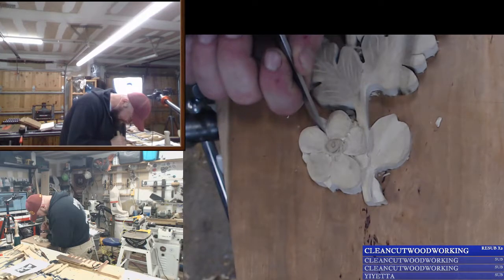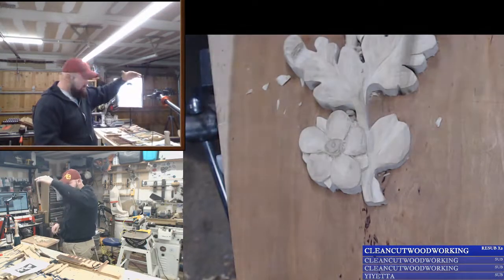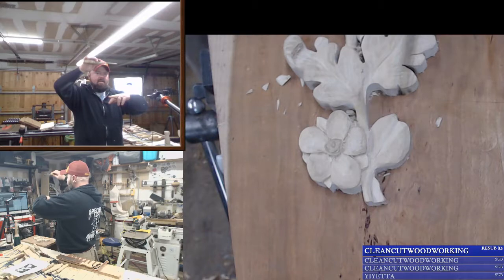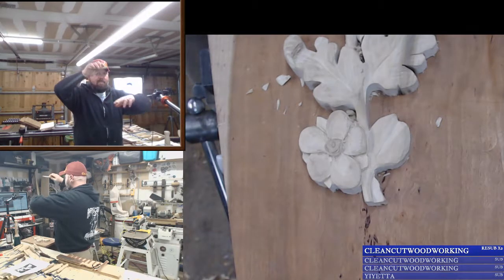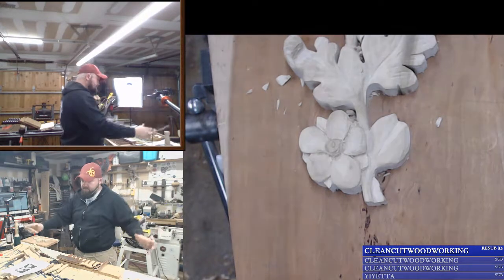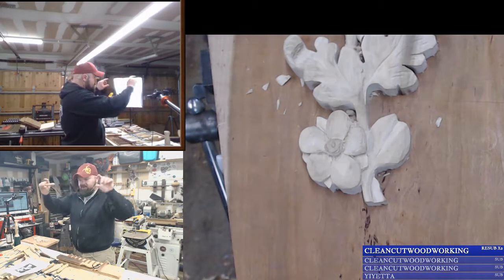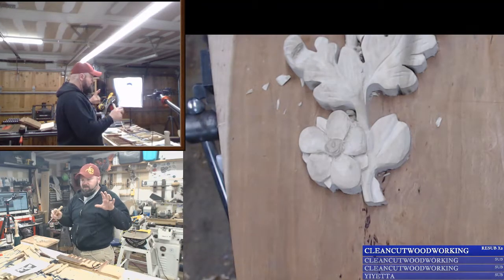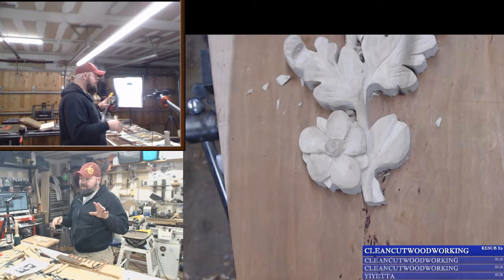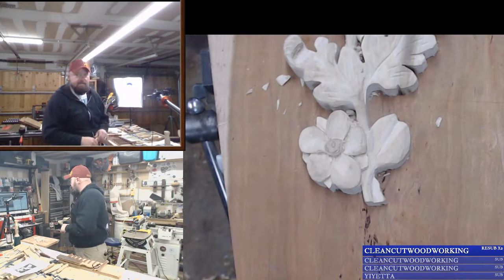I did a frame. It was about 59, 60 inches long and 3 foot. So it's about this long, about this high, and it's on my website and Instagram. It had a four and a half inch perimeter of teak, and then it had slats. Then on the inside, it had a 2-inch perimeter, and then the panorama went inside. But I did it without any screws or nails or staples. So I did all the joinery for all of that. And then I put gigantic dovetail keys in the corners and let them in solid, and then ain't going nowhere.